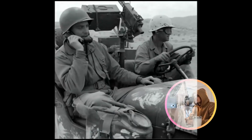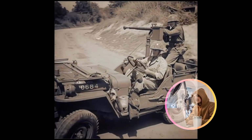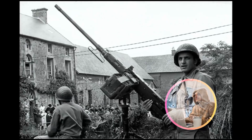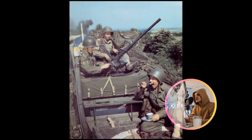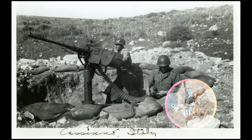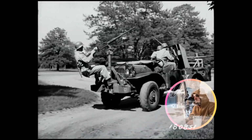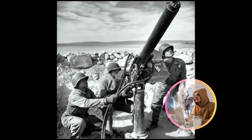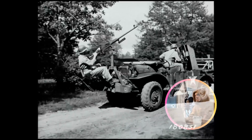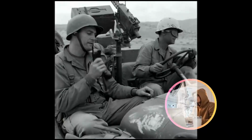The actual manufacturing processes exhibited a striking divergence in their level of sophistication and standardization. On one end of the spectrum, the 51st Ordnance Company on Luzon established an impressively efficient assembly line, capable of producing 4 complete mounts per day. This operation leveraged standardized jigs and employed dedicated skilled welders, achieving a remarkable degree of consistency where their manufactured mounts were practically interchangeable parts. In stark contrast, the 127th Infantry Regiment on Mindanao relied on the individual efforts of a single corporal whose welding skills were, by his own admission, marginal.